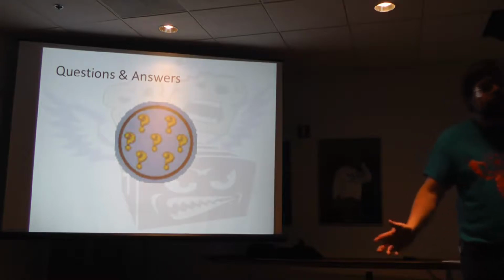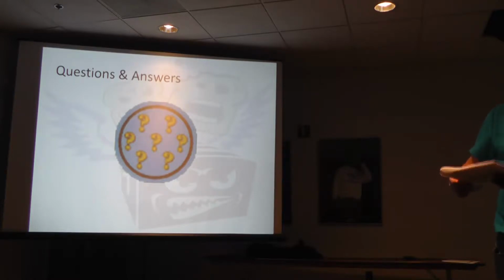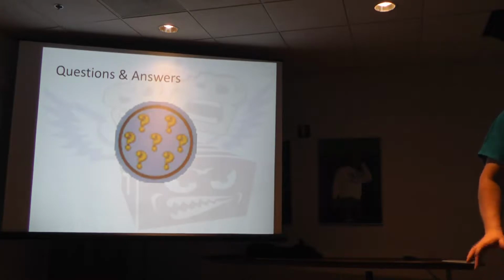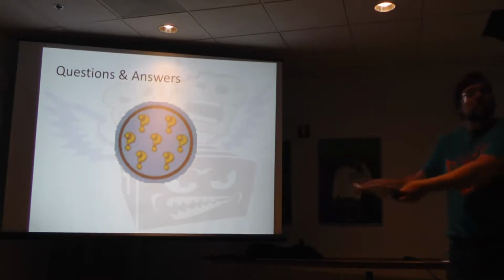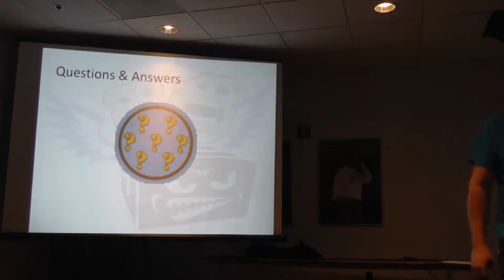Now, in the meantime, if they've got solutions, by all means, draw them, sketch them, record them, put them into another file. And since QFD is done, then you can compare them. We don't squelch people from coming up with solutions. We just ask that if they do come up with them, they don't show them to anybody or talk about them until after QFD is done, because we don't want to bias QFD.